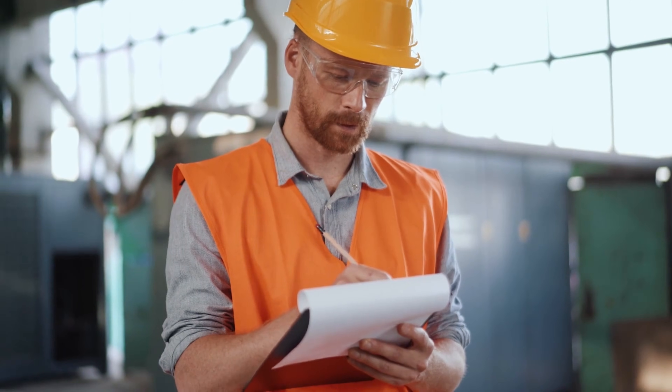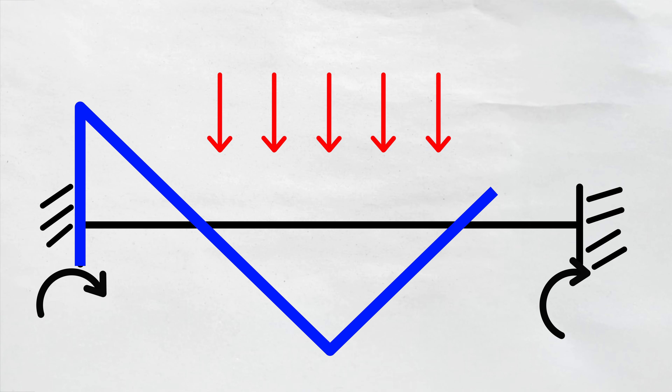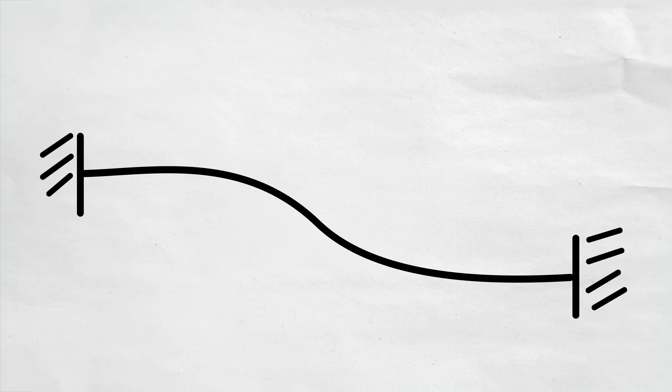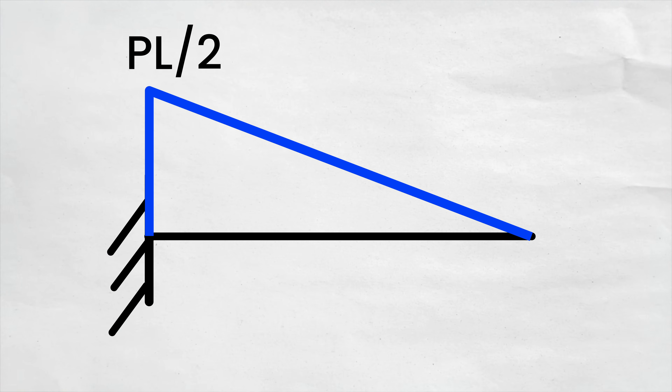We can see a simple back-calculation and break this down in a simple form. We've got a moment with two fixed ends. How do I look at how those loads are transferring? It's very much similar to how you look at a fixed base connection. You've got a differential movement on one side, which means there is a moment that needs to transfer. So those plates need to transfer it in flexure — but it's not just straight flexure, which would simply be P times L.